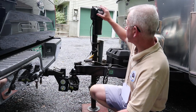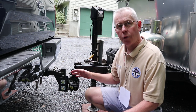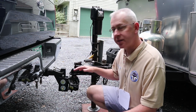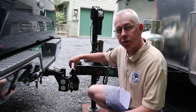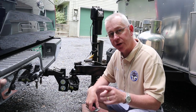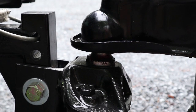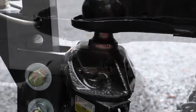The next step is to raise the assembly — this depends on your hitch. With my Equalizer four-point sway control hitch, I raise the assembly up anyway, but with my old Reese hitch I didn't need to. So independently, I raise the jack with the ball onto the receiver to check that the coupling has actually been made effectively. Get up close and personal and wait for the moment when the top of the receiver comes off the ball and the catch catches — then it raises the entire assembly up and you'll be sure you've got a good connection.